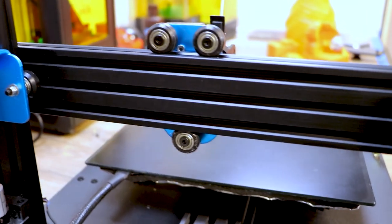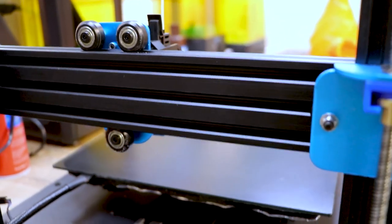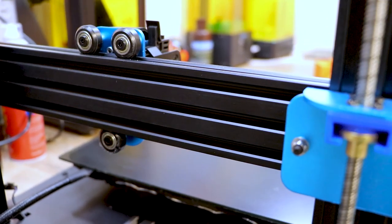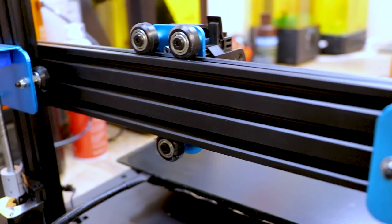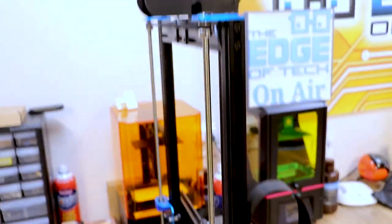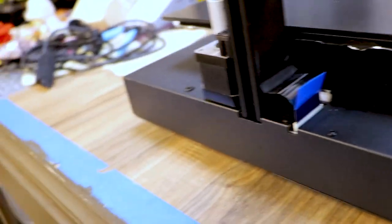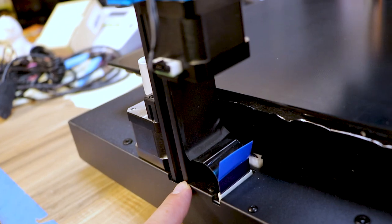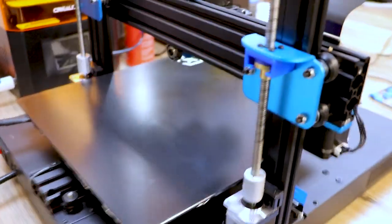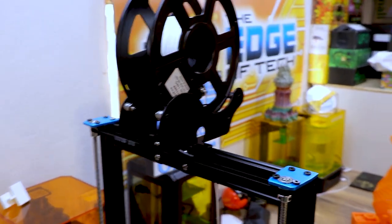The X-axis is also really big. They use three wheels in a triangle fashion like we see on most of these printers. Everything is really sturdy on that X-axis, and that's not going anywhere anytime soon. The installation was super easy — the full gantry came as one piece, and the base as the second piece. All you do is drop the gantry onto the frame, put four screws in from underneath, and that is done. About 15 minutes total, maybe 20 if you've never put a printer together. Once you get that done, put your spool holder on and you are good to go.